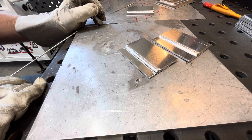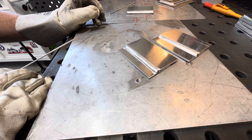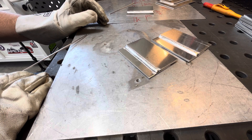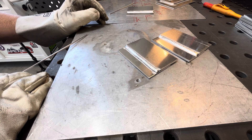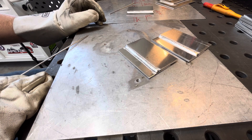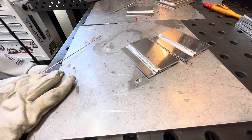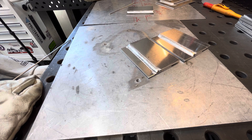If anybody has any good ideas for videos, I have a few weeks where I can make some and don't have a ton of projects going on. One of the things I wanted to do was a little bit of mixed AC/DC welding on some thicker aluminum — showing the benefits of how a lot of these newer machines have a mixed AC/DC mode where they're putting DC in while you're welding on the AC waveform to get more penetration. If anybody has other ideas, please comment and let me know. Hope everybody has a great weekend — like and subscribe.